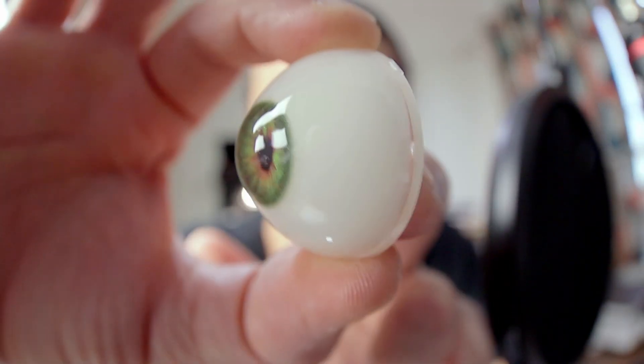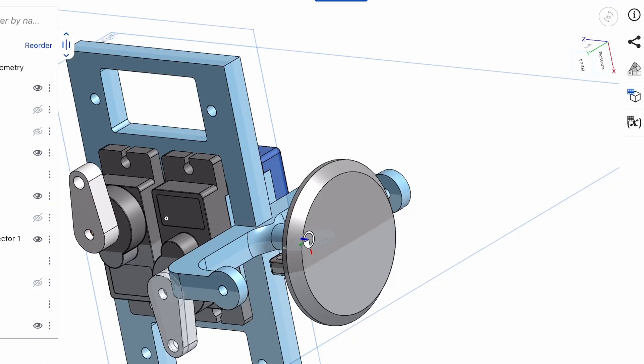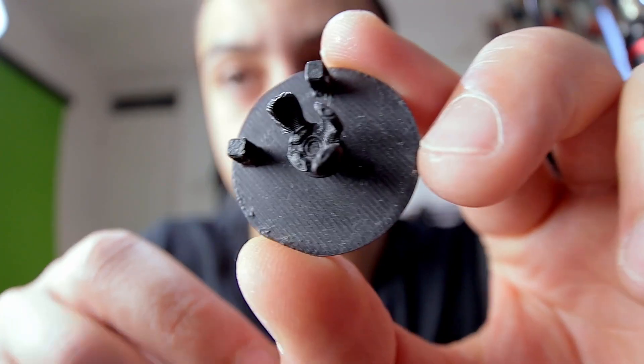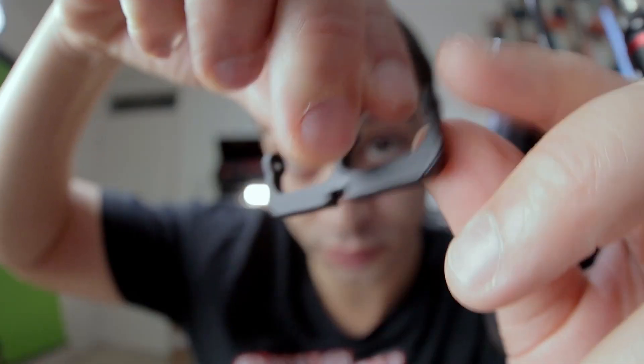Challenge number two: I needed a frame that can actually hold the eye and the eyelids. The eye needs to be able to rotate in all directions — up, down, and side to side, both at the same time. I saw a lot of eyes that use a universal joint but since I wanted everything 3D printed I went for the simplest option: a ball joint. I first cut four slices into the fitting piece for flex, but that made it fragile and pieces kept breaking off. I removed two slices but it still broke. Turns out the plastic is flexible enough to just pop the ball joint in without any slices, making the connection much sturdier.